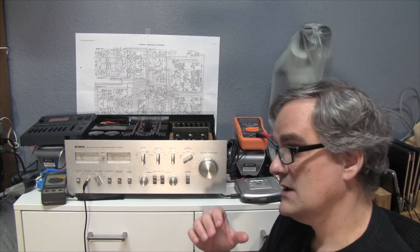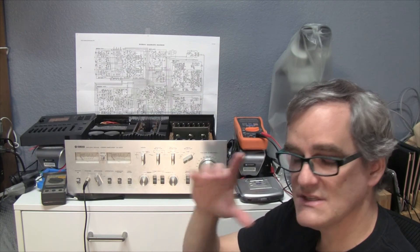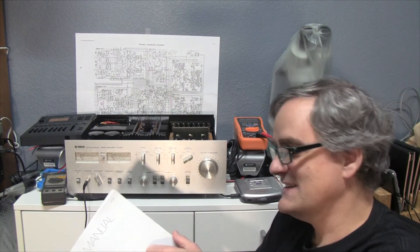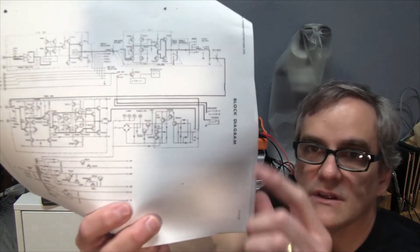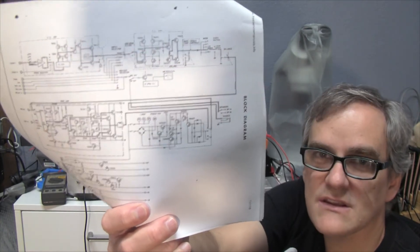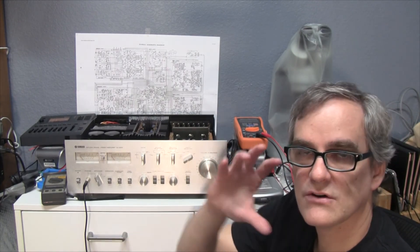It's amplifying just enough to be heard on the headphones, so that's actually a good thing. Obviously I need to find where the problem is on the signal path. On the other hand, I have a consistent signal path — the signal is actually going all the way down to the output. With the help of the service manual schematic diagram visible here at the back, I can see that the headphone output goes all the way through the signal path, almost to the very end. So this is very good news for the amplifier overall — things seem integral on the signal path.